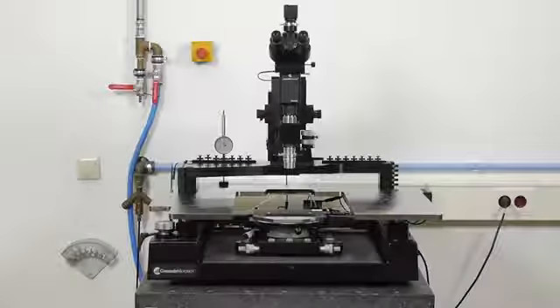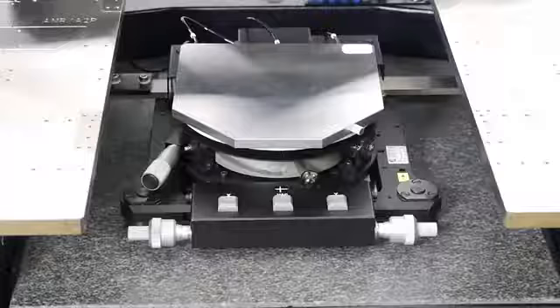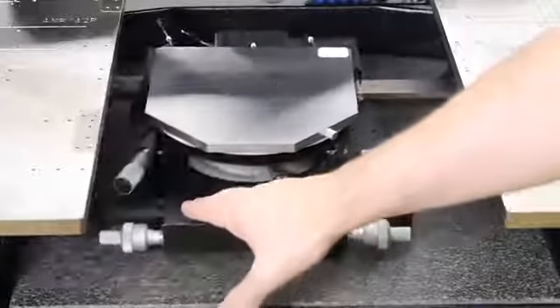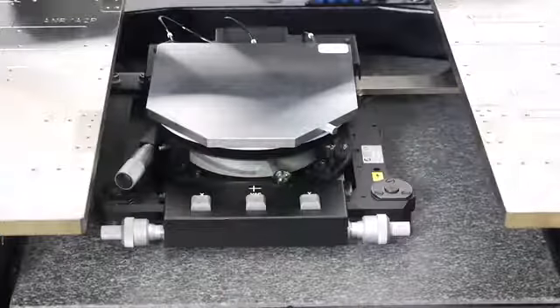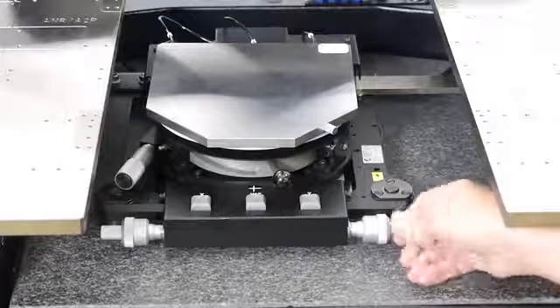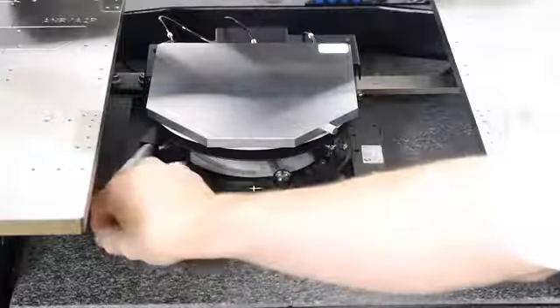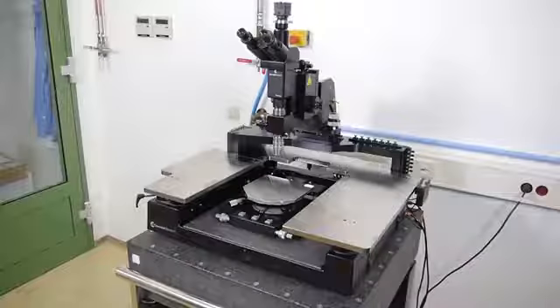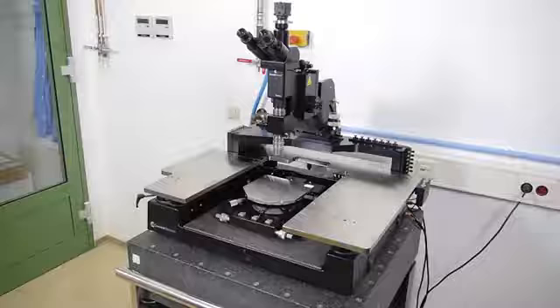Here is the EPS 200 mmWave manual probe platform, on which I will demonstrate this to you. This platform enables various broadband and banded mmWave application setups by using so-called Sigma integration kits. We have chosen this platform as it allows a quick and fast movement between the calibration area and the main wafer area in combination with the overlaid true submicron chuck positioning. Also, the rock-solid vibration and drift-free setup is essential for good mmWave measurements.